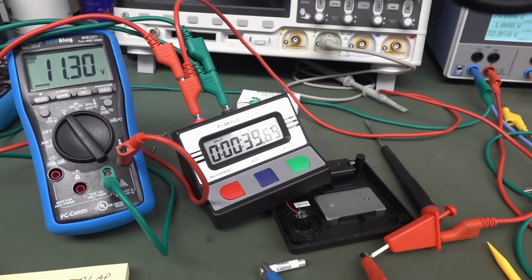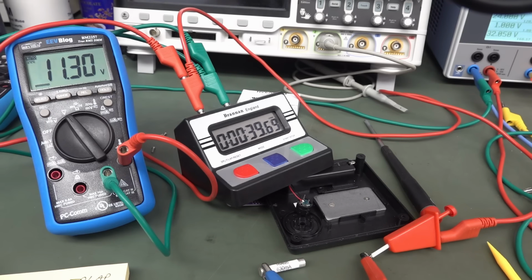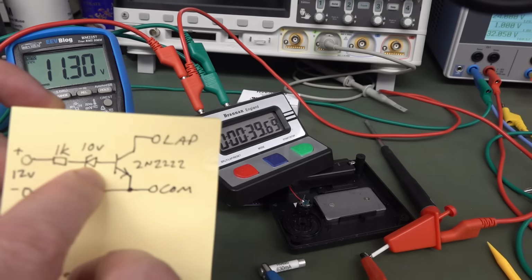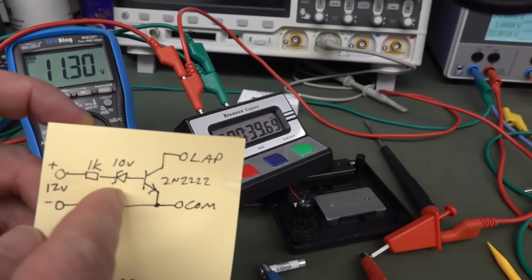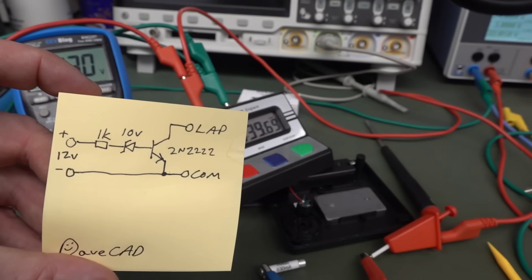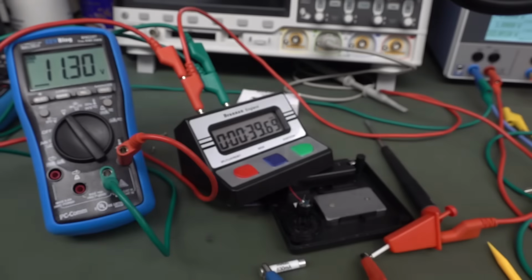If I had $1 for every time I put a Zener in back to front, I think, geez, I'd be rich. Yeah, your mind just thinks, oh yeah, it's a diode, and you don't realize, oh, Zener diodes, it's got to go in backwards because they're reverse biased. That's how the breakdown voltage works. Yeah, you can put it the other way. It works as a regular diode just fine, but yeah, not for this circuit. We wanted to drop that voltage.